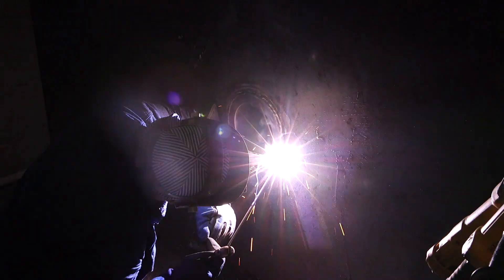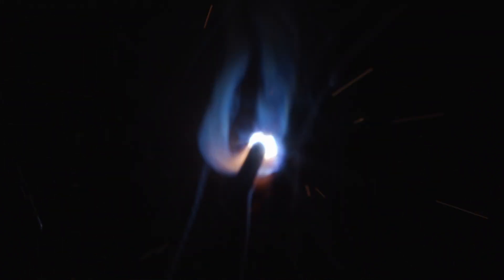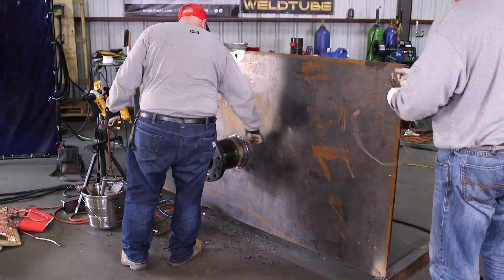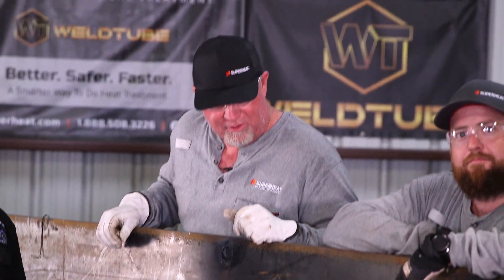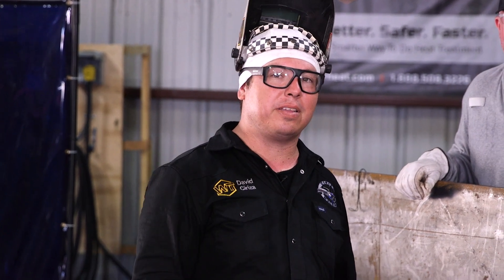I'm going to do my third and final bead on this cap. We're finished up with this nozzle weld. I'm going to have the Superheat guys take down all their equipment so we can finish up. David and Andres got this thing welded out. You can see with our MagnaMat technology how fast we were able to strip this thing out and get the site cleaned up. There you have it — we showed you a full penetration nozzle weld. Me and Andy, brother-in-lawing it. Andy was on the inside of the vessel. If you like this video, don't forget to like, comment, and subscribe. Catch you guys in the next one.